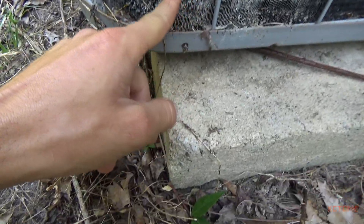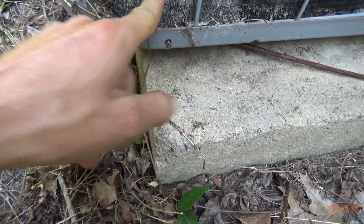I don't remember the last time I was actually able to get back here, but you can see that all the paint came off the coil. These ICPs, they paint them, but you could not see through that coil before we cleaned it. It's smooshed in on some places but it's not terribly bad — you can actually see through that coil pretty good. Especially down here at the bottom it was bad. And we did find some coil rot down here on the bottom — the coil's starting to come apart.